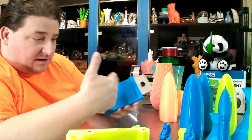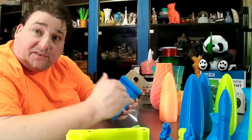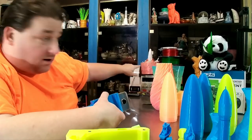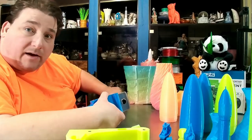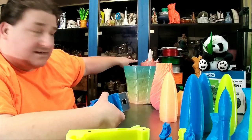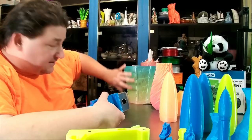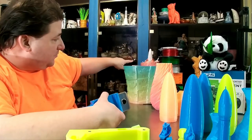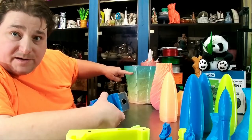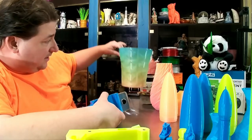There was no point in doing the phone cases in the rainbow color, because not enough plastic is used in a print like this to see a color change unless you planned it carefully. That's why I stopped the bucket print — I wanted that color to start down here and change as it moved up, and to get that three-color change I had to stop and restart it. Had I continued printing, I'd have missed that third color change.